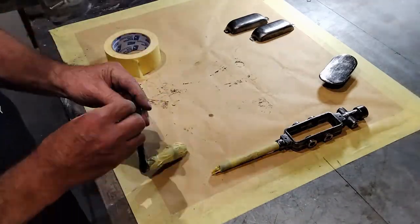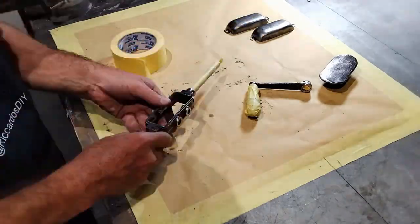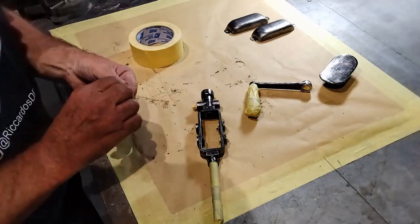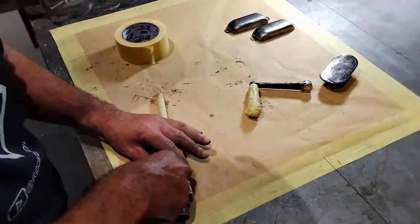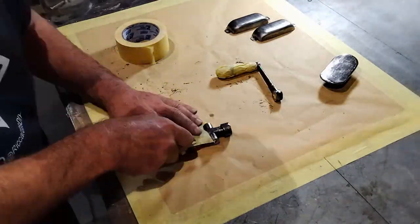In this case, I use a spray putty as the primer, as this allows me to apply light coatings of body filler over all the parts that I want to paint. Wet sanding the spray putty will ensure that we have a properly prepared surface that will also maximise paint adhesion. As with painting, many light coats are better than heavy applications.